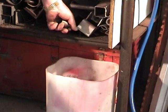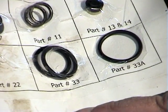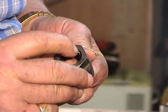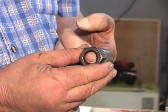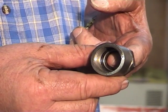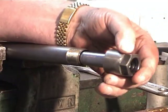Dispose of old O-rings immediately. Wash the collar in solvent and make sure you dry it thoroughly before proceeding. We now take parts 33 and insert them onto the hexagonal end of the shaft collar — there are 2 parts 33. We then turn it over so that we can insert part 33A onto the inner ledge of the shaft collar.